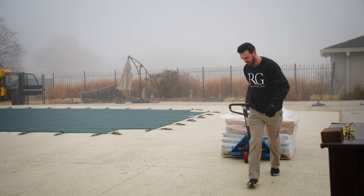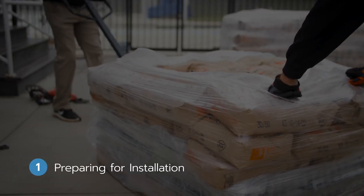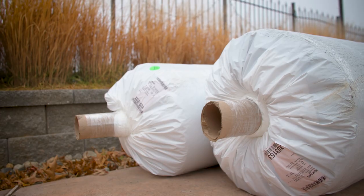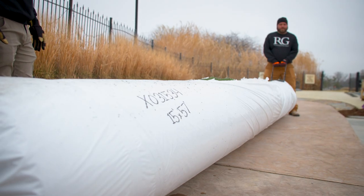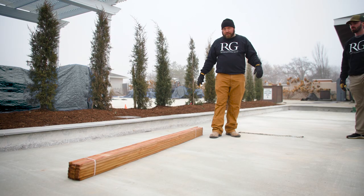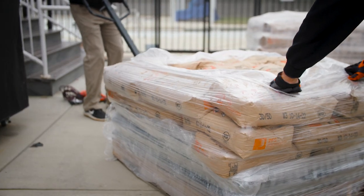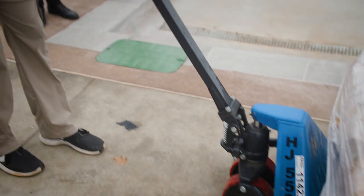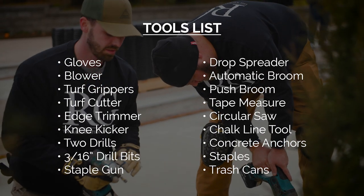As these processes neared completion, the team began to prep for the turf installation. Step one: preparing for installation. For these two courts, our turf manufacturing facility delivered two large 15-foot by 60-foot rolls of turf weighing approximately 225 pounds each, four pallets of drainage ultrabase panels, pressure treated nailer boards, 41 bags of infill, and 11 bags of top dressing in 50-pound bags. We needed to ensure that we had equipment on hand to move these materials into position, and our team assembled the tools for the job.